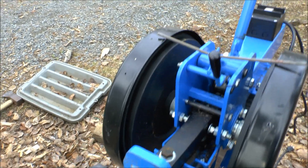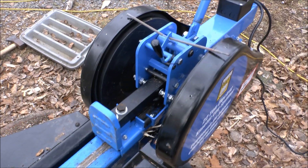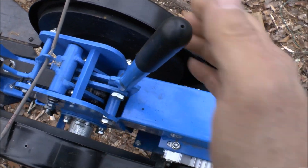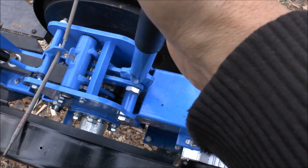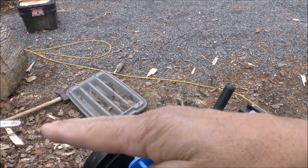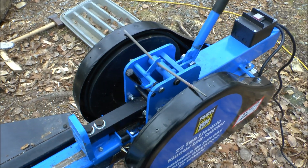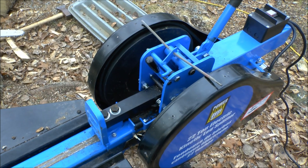If you drive it down again it would move forward and do another cycle. It's pretty simple — not complicated at all. The way this works: the linkage pushes that little roller down on top of the rack. The rack is held up with a spring, so when you engage it, it pushes the rack down to grab the spinning gear and drives it forward. Let off, the rack pops up and it stops moving, or the spring underneath drives it back.